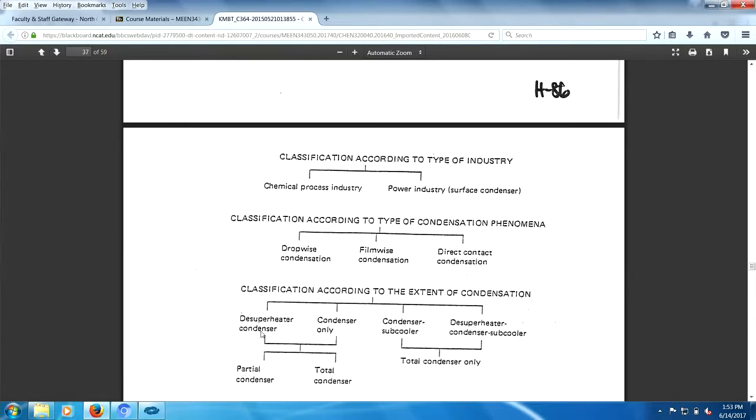So maybe I have a lot of hot steam. The steam will condense at, say, whatever, 200 degrees C, but it's at 250 degrees. It condenses at 200 degrees C, and the stuff is at 250 degrees. So it has 50 degrees of superheat in it. So you drop the superheat down to the condensation level and it condenses. So there's two things involved. You do the condensation and you also do the desuperheating. Condenser and subcooler, there you go.